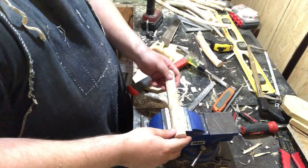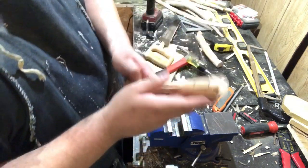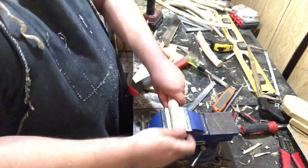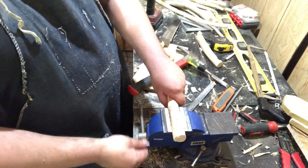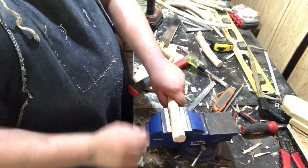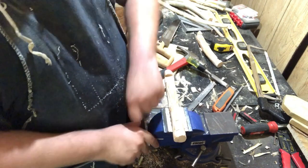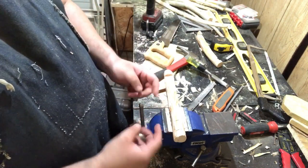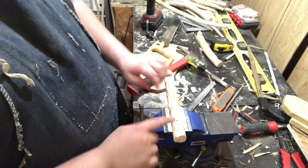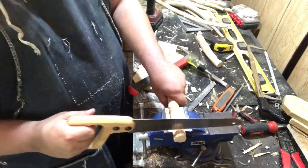Okay, cool. So go ahead and make your marks where you're going to do your notch. I made mine already. Right there. Boom, boom. It's going to be in between there. If you have a vise, it's easier, because you can just go ahead and vise it down. Cool. So I'm going to vise mine. And you don't want to go too hard, especially because usually vises have rigid insides and you'll mark the wood. I mean, it doesn't matter if you don't care, but...